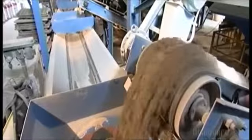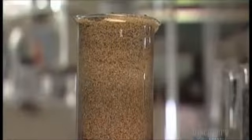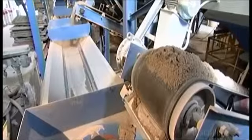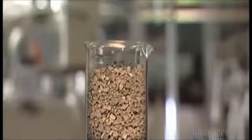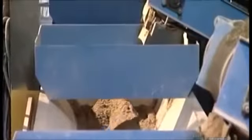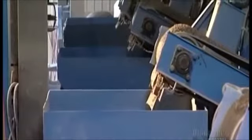To make these pavers, a conveyor belt delivers concrete sand to a weigh belt that weighs the coarse sand as it falls onto it. The weigh belt carries the sand forward, while another conveyor belt unloads stone chips to be weighed. These chips are no larger than a third of a centimeter. The ratio of sand to stone chips varies depending on the type of paver being made.